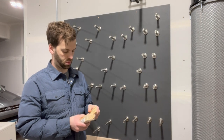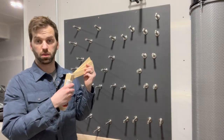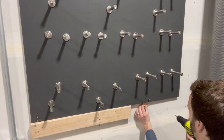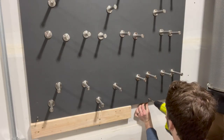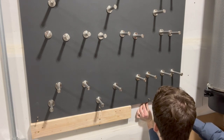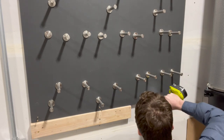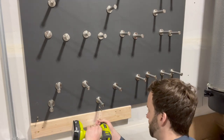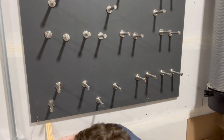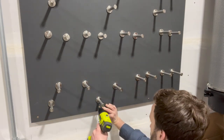Here's my secret tip for making this thing look great — it's just a 99-cent pack of shims. By inserting a shim next to each of the screws on the bottom row, you are rotating the board ever so slightly up. This causes all the tools to lay evenly against the back of the board. And because you used a short 2x4 leaving the last stud exposed from below, the first bottom screw can go in right away. Then just remove the 2x4 and drive in two more screws with matching shims.